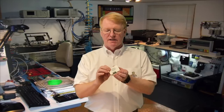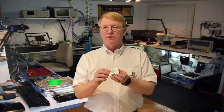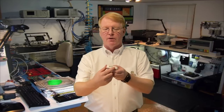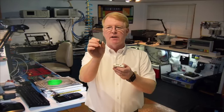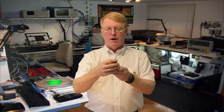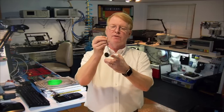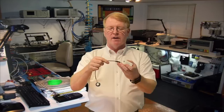It has a built-in speaker with a baffle built inside, so even though it's a pretty small contraption, it gives a big sound. But perhaps you want to have the controller near where your electronics are or switches, but you want the speaker out in the layout — there are two ways to do that. The first is a plug with two terminals for mono sound; you plug it in and that turns off the internal speaker, and you run your wires out to your speaker anywhere in the layout. The other is a mono plug — I just soldered it to a very simple speaker — and you just plug that in, and both of these connection systems are available.